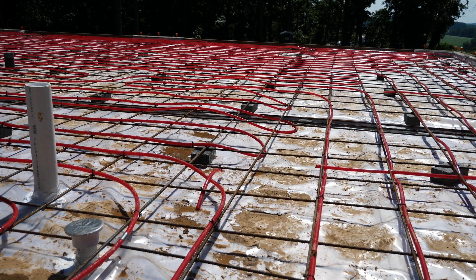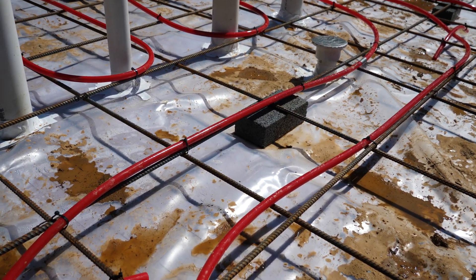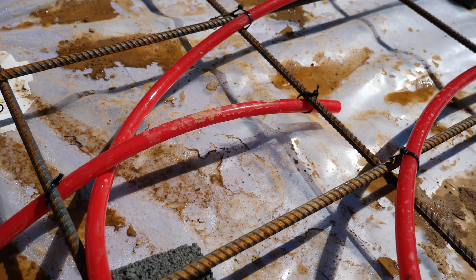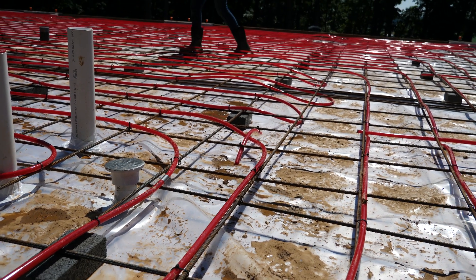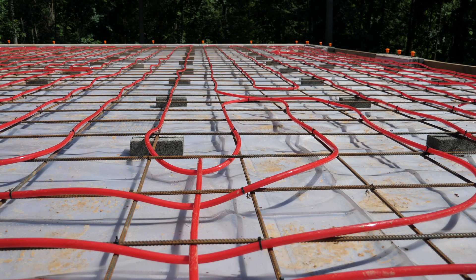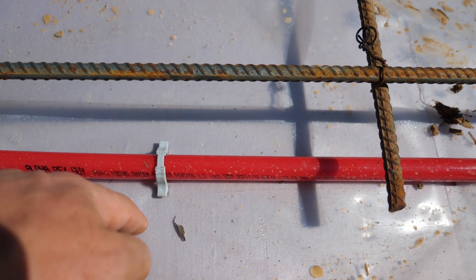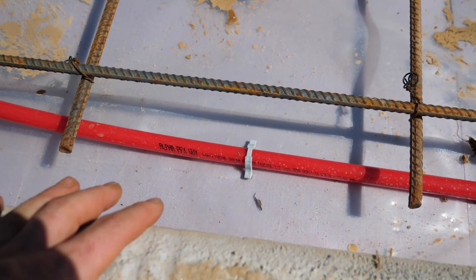Because the tubing is on top of the rebar and we're still putting control cuts in, we carefully marked out where the cuts are going to be and made sure the tubing is low in those areas. I cut some scrap tubing and shoved it underneath the rebar but over the tube, which effectively presses it down a bit. We also ran string lines across all the control cut areas and measured down to confirm we had plenty of clearance for the saw. In another control cut example, we used a scrap piece to bend tubes down, and where needed I used foam board PEX staples to hold that small section in place.